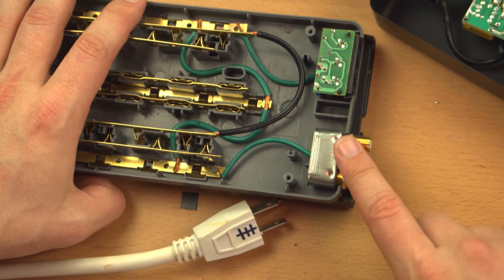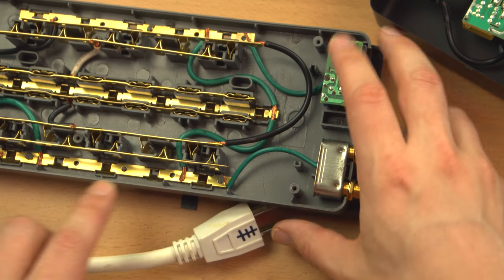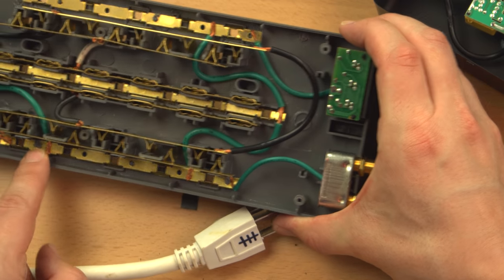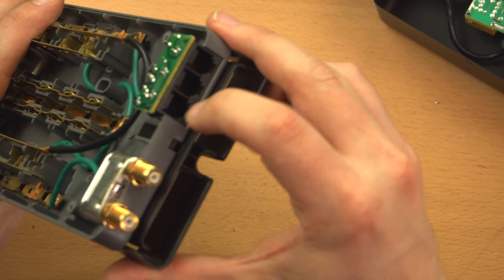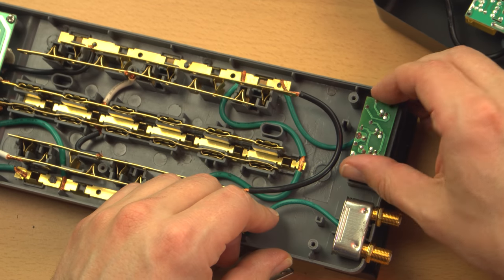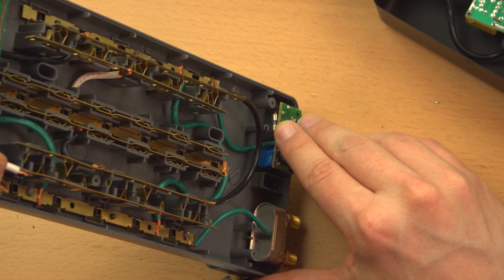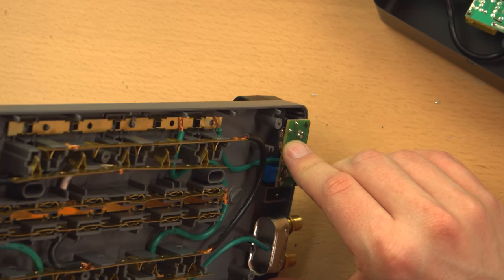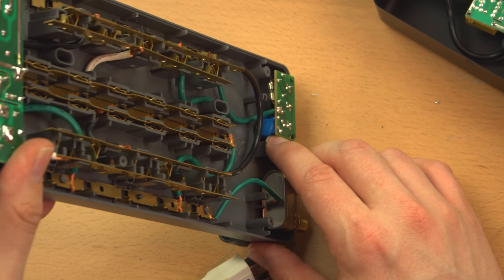Not necessarily the best thing to put in line from a signal quality perspective, but it is grounded. It's bonded to this bus bar. And this right here, I should point out, is another telephone. I know it's a lot of focus, but you got 3 phone jacks there. It's another telephone style surge suppression module. It's got a fuse in there, which is kind of interesting, which I guess would stop any major overcurrent issues. It also has maybe a metal oxide varistor.